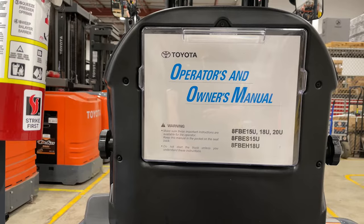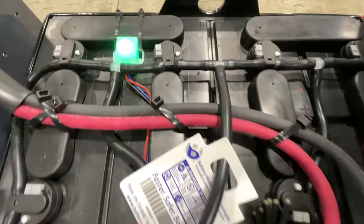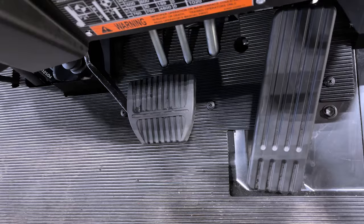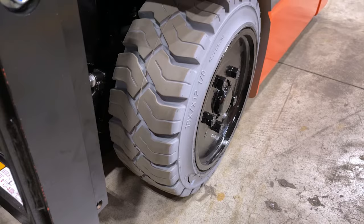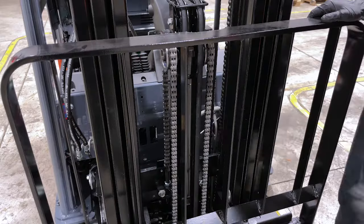You can reference items in the manual such as safety, controls, operator display, troubleshooting, and daily maintenance. When watering your batteries, do a visual inspection to ensure the terminals are clean and there is no visible damage to the battery. Check floor pedals to make sure the rubber has not worn down. Visually inspect your tires to make sure they are not showing signs of wear. Check that cables are not cut or frayed, which could cause sparking.